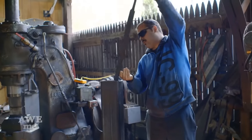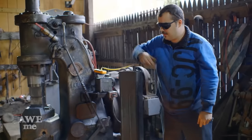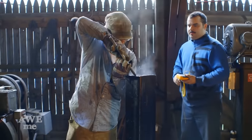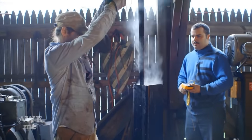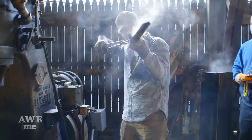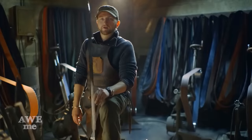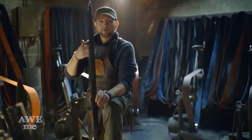Now that the blade is fully hardened, we have to temper it. We place the blade into a hot oil bath around 450 degrees for about an hour. Asuna's rapier appears to be straight. No need for final fixing. It's ready for Matt.